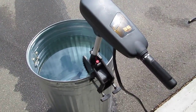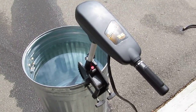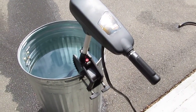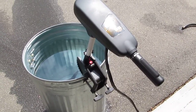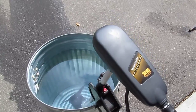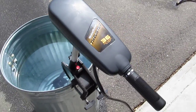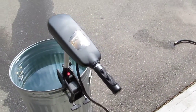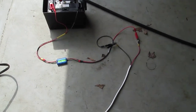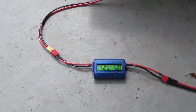This is a quick review of an about 10-year-old MotorGuide 12-volt trolling motor with 36-pound thrust. This is the old-style 5-speed forward and 2-speed reverse, using not an electronic speed control but resistors — located close to the motor — that lower the amperage draw and change the speed.